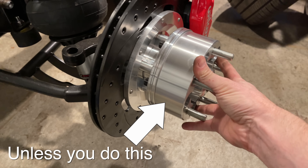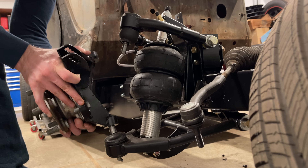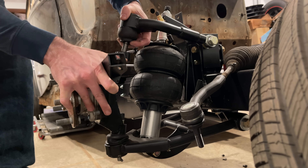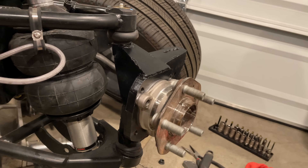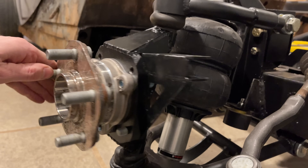But I can do it the other way around: the steelies will work on the Tesla hub. So I figured, why not make custom uprights that use the Tesla hub based on the existing Mustang II geometry? So I'm going to have a 1950 Jaguar connected to aftermarket suspension arms based loosely on a 45-year-old Ford design, connected to a custom upright that holds a modern Tesla hub with shiny Wilwood brakes. Super simple.